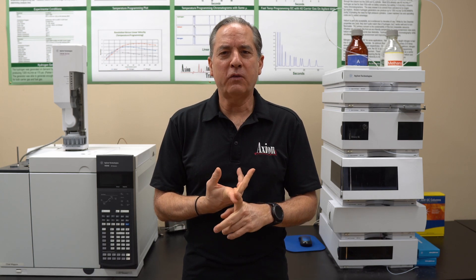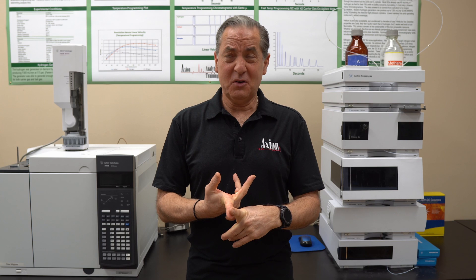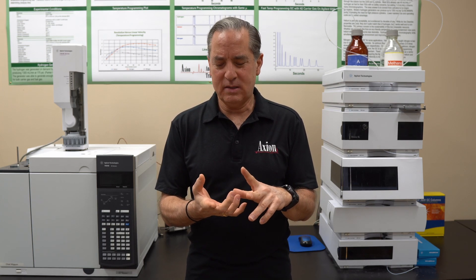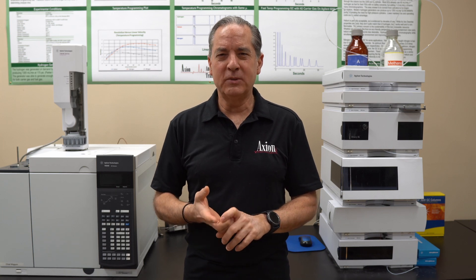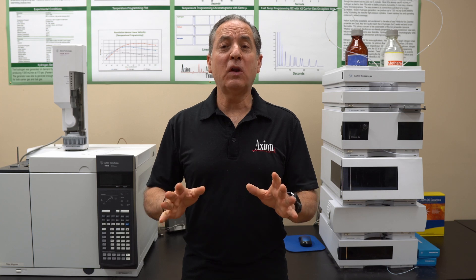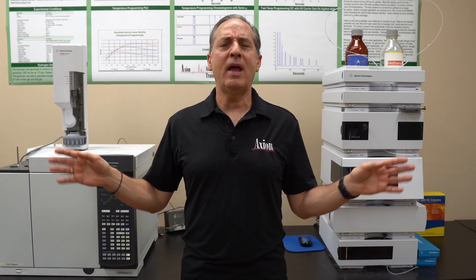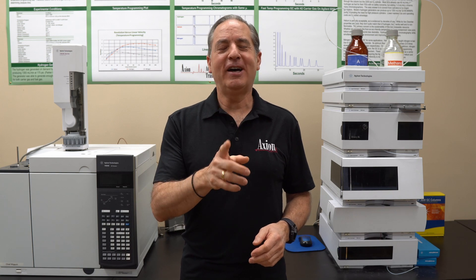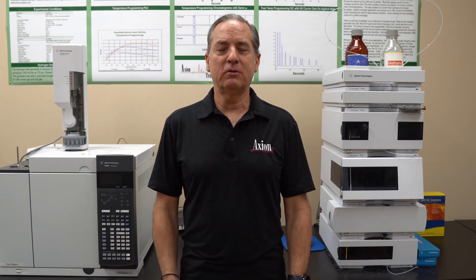Gel permeation columns are also fragile — you don't want those to dry out either. With ion chromatography, I'd get nervous if the column dried out, though I wouldn't completely panic. The other non-silica-based and size exclusion columns — those I might freak out about because they're fragile. But short of those specific column types, most columns out there will not be damaged by letting air run through them. Don't make a practice of it, but you've done no damage — your instrument is fine.